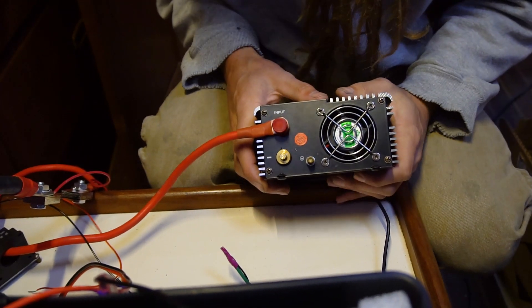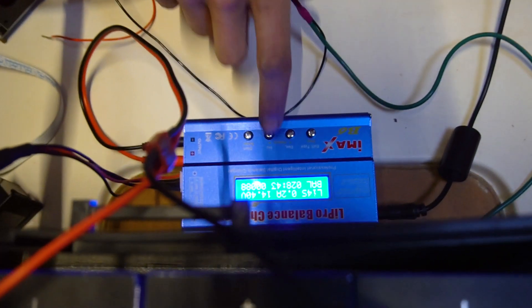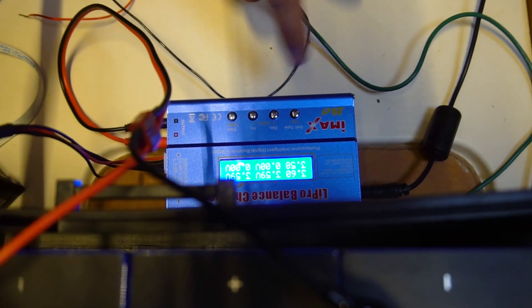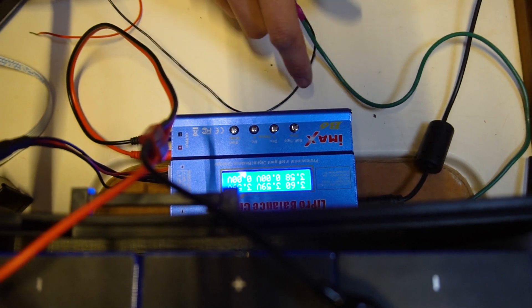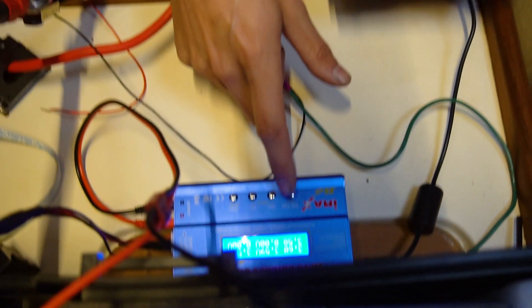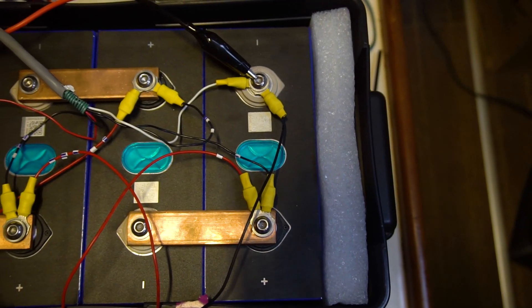I already charged the capacitor so there should be no spark. Now we're just waiting for the charger to say it's only putting in 0.1 amps — we're going to call that charged because we're at 3.6, 3.59, 3.59, and 3.58. In the next 10 minutes I expect this to be as close to fully charged as possible, then we'll let it sit for 15–30 minutes for the voltage to settle. Then we'll start a capacity test, and now we're just going to hook up the voltage sensing wires for both the Hall effect sensor and our shunt.